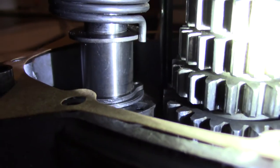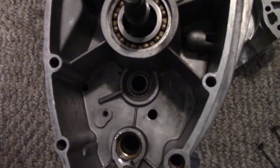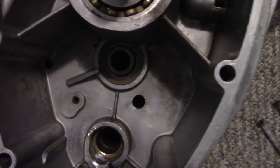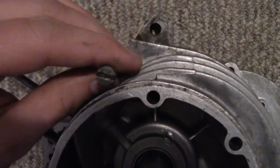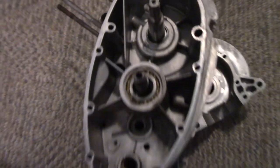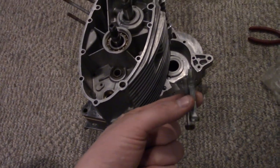This was definitely the better way to do it, because now I can actually adjust the ring and watch the spring feed down onto it. I can move it back and forward and actually watch as I guide the spring into its hole. So yeah, this was way easier — far better idea. That went pretty easily. I'm definitely sure that the starter spring is in the right place now. Rollers are turning nicely as well, and I was able to get them in there without any falling out. So the last thing to do in this step is just get these three bolts in their places. If you watched me disassemble this bike, you already know where these go. This guy goes in here — I'll have to align the gasket. On the other side of the case, the magneto chamber or generator chamber is where these two guys go.